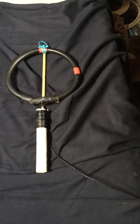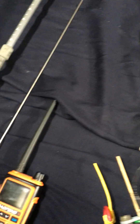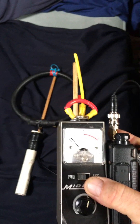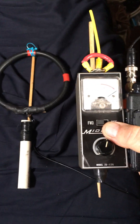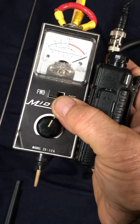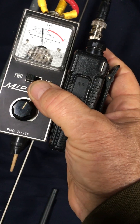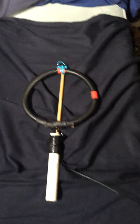To verify these antennas are working in magnetic loop mode, we take our VHF transceiver on two meters and do a one-antenna test. Using our handheld field strength meter, we transmit — 'hello, one-antenna test' — and there should be a null as we approach. Sure enough, there's the null right about there, so this antenna is definitely operating in magnetic loop mode.